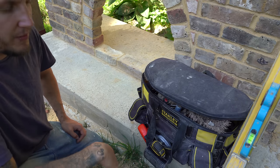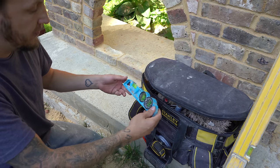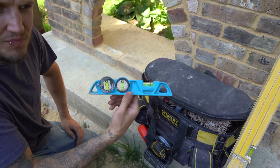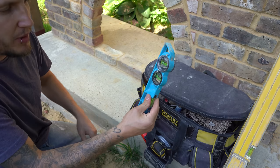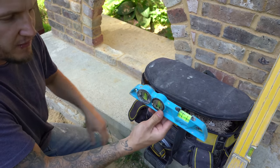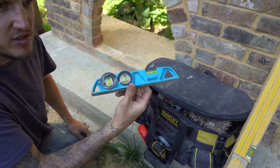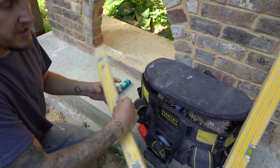We'll start with the things that are out of the bag — the levels. I have four levels here. First off, a boat level. This is useful for small areas. I like to use a boat level when plumbing up the first three courses of building a corner and in tight little spaces. It's a very small little boat level, often known as a boatie.